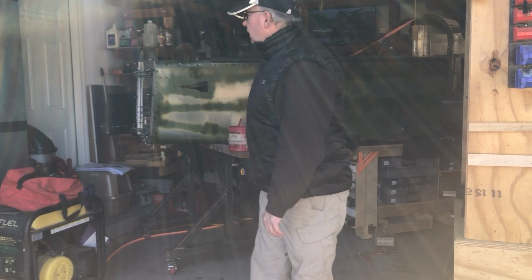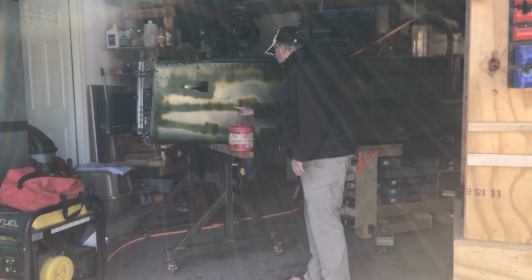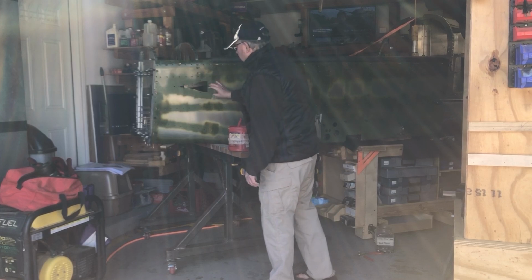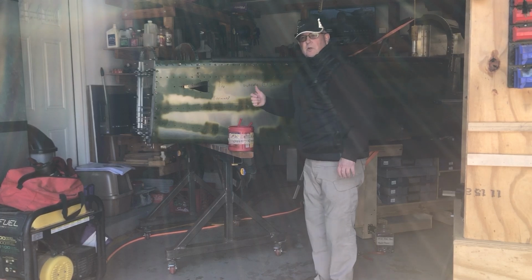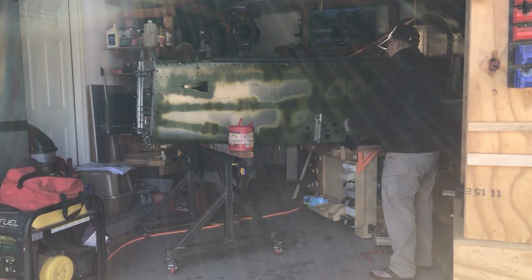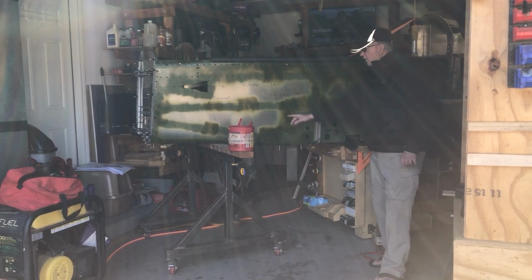And I had painted some zinc oxide along where the rivets go and all this stuff, and I had marked out where I have to dimple and everything. And this left outside skin, up and forward, and the NACA ducts go in here. But I forgot to roll the film while we were putting this up, but it's only been a couple minutes, so we stuck it up and just started putting the pickups into the major wing spars here. Got those lined up. Have not gone underneath and put the underneath ones on.